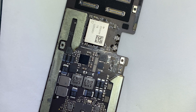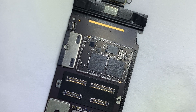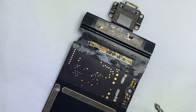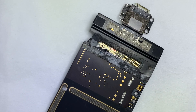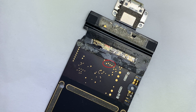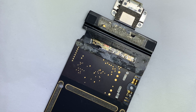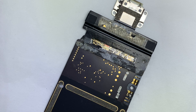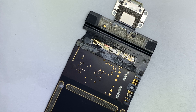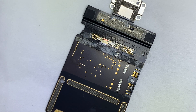In most cases, this fault comes from the transistor. So let's find the test pin for the transistor. Looking at the back side, you can see the test point marked in the red circle. Check this point to easily find whether the transistor is faulty or not. You can find the test point reference in the description below.